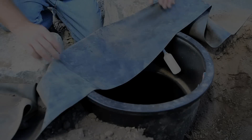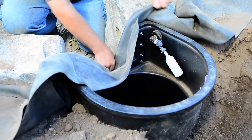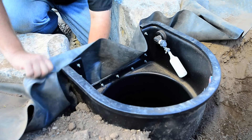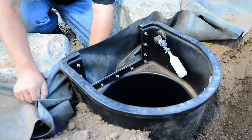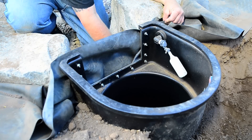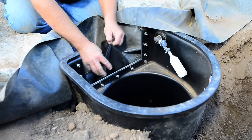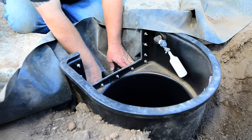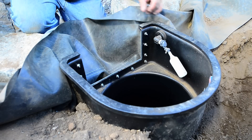As you can see, we have plenty of slack in the liner to make the connection. I'm going to reserve that slack down below the skimmer in case we need to make an adjustment in the future, pulling it down but not cutting off the extra — I'll leave it all at the bottom. Also make sure you take the underlayment and get it tucked down low, because it cannot be part of the faceplate attachment — if it's in the seal, it'll leak.